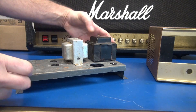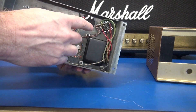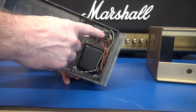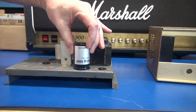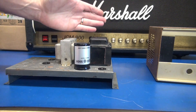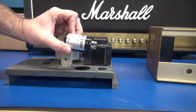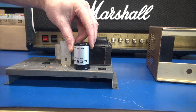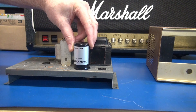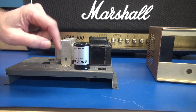If we take a closer look at the chassis, you'll see why we can't put the power switch here. It's because our rectifier tube socket is right there, and next to it would be our new filter capacitor. The old filter cap was bad, so I'm replacing it with one of these nice CE distribution types that you can buy from AmplifyParts.com. This is a dual 32 microfarad at 500 volt cap. It'll sit right there with a bracket.